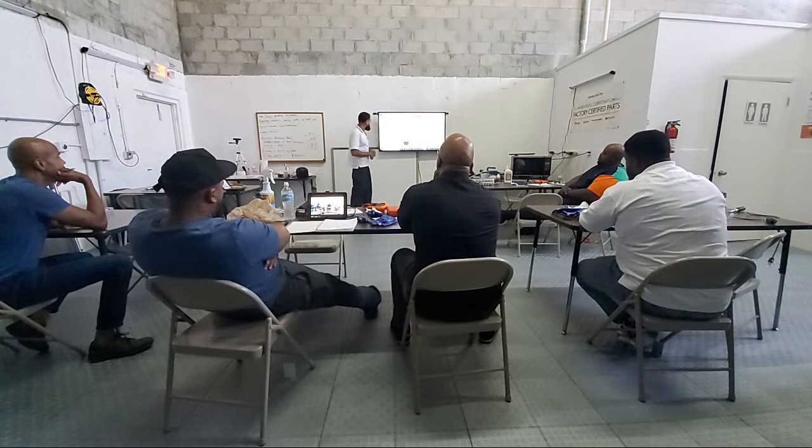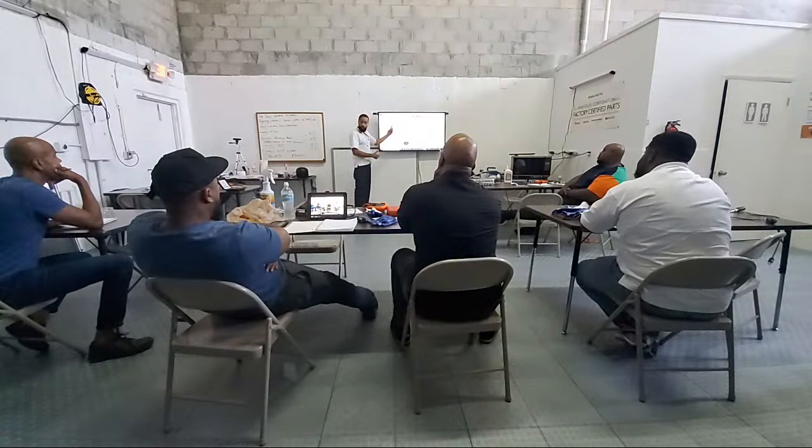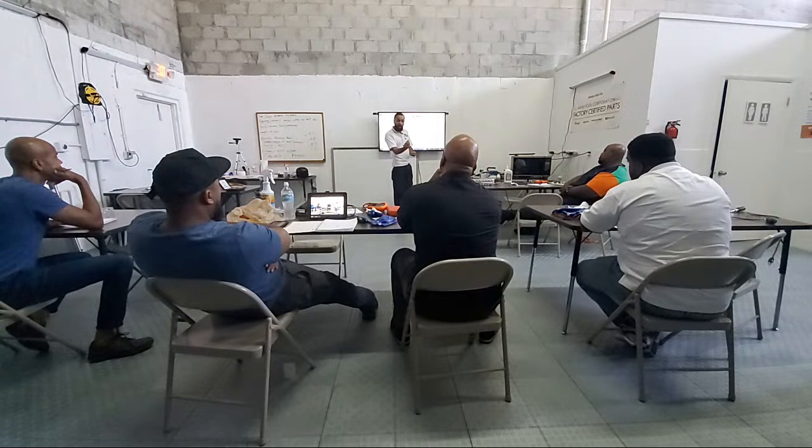I told you that as you put nitrogen into this low side, right here, what did I tell you, a rag? You've seen the video, they put a napkin. Check your hand, put something there, because you want to inspect what comes out of it. Is it black, oily, sooty? Is it white, powdery dust? What are we dealing with?